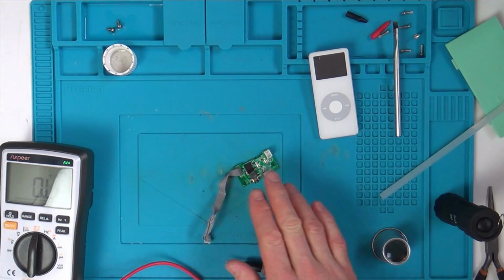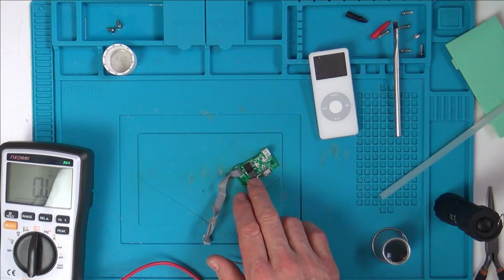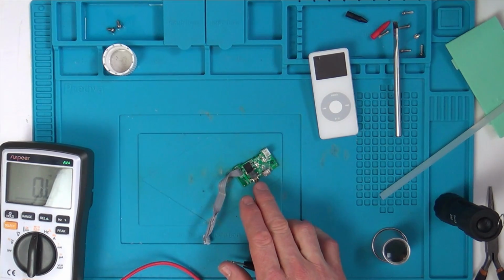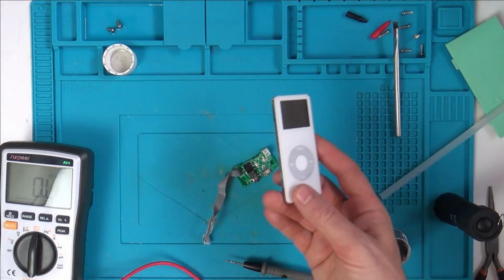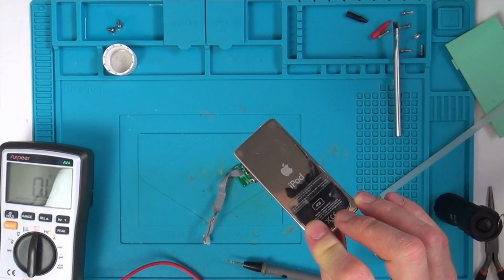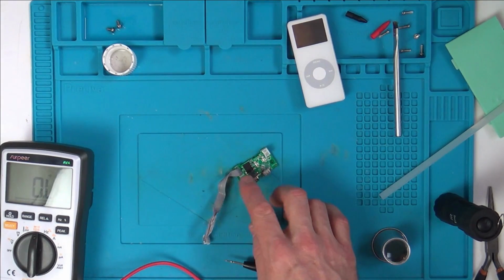This one here goes inside, a few millimeters back, and that's exactly why it's not working with these headphones. So it's not actually a fault, it's just a really bad design of a headphone jack. I can understand if this was around 20 years ago, but we're talking about a product from only a few years ago. And if this can manage it between a 3 and a 4 pole, which was around 15 years ago, maybe longer, then this one should definitely be correct.